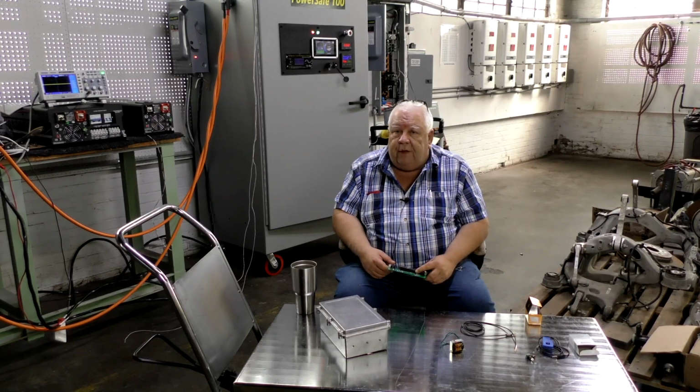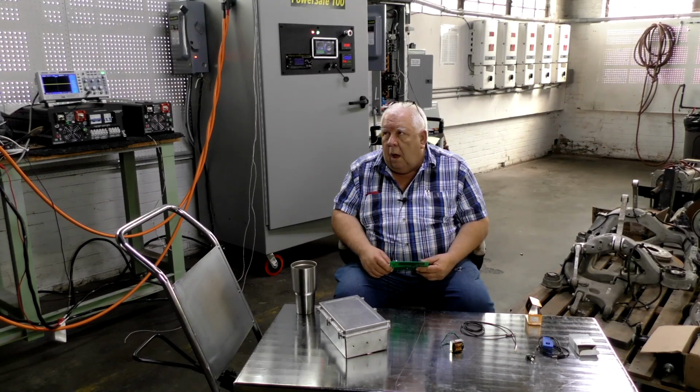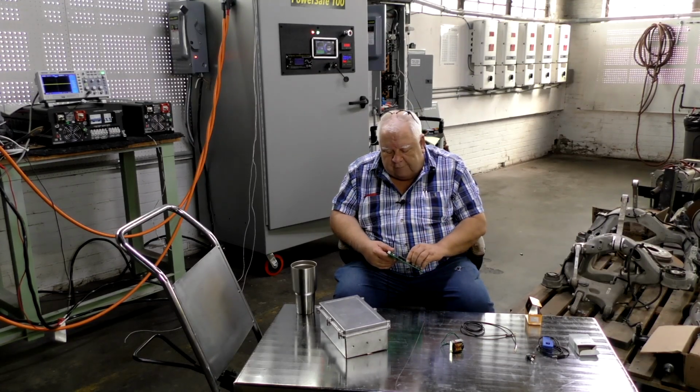We can take advantage of this in determining which direction the power is flowing, but you have to have a device that can simultaneously measure voltage and current and the phase angle of that. And this Analog Devices chip can do that. And it's designed to monitor 3 phases. Almost all the products we've seen on the market are designed for 3 phases and don't work very well measuring 2. Then there's some single phase devices that work on your 120 volt plug-in. And that's not what we're after either.